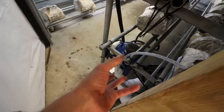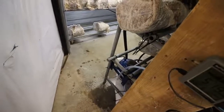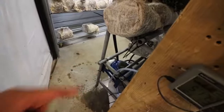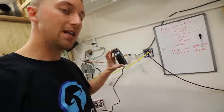The reason why I don't use IF fans for circulation anymore is that the housing is very hard to clean out — you have to take it apart. For exhaust it's not a big deal because it's just putting air outside, but for circulating inside the fruiting room you don't want a fan that's difficult to clean. These push a lot more pressure, so they're better for actually moving air around. If you want to move air through piping, use an IF4, IF6, or even an 8, 10, or 12. If you're just moving air around inside the fruiting room with no resistance, just use an axial fan.